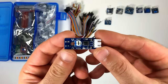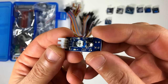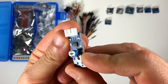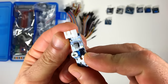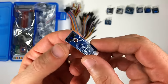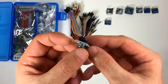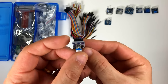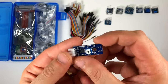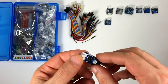Here we have the tracking sensor. This is sometimes used in robotics to keep a vehicle following a black line. The blue LED is an infrared transmitter, and the black thing is an infrared receiver. When the infrared light hits the black line, there's less reflected light picked up by the receiver — the sensor outputs a high level when it's over black. When the light hits a white color, it's reflected back and the module outputs a low signal. The trim pot adjusts the sensitivity.